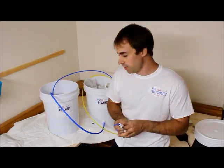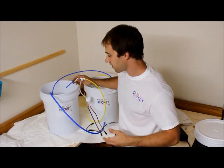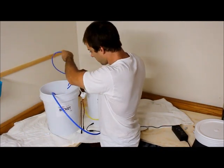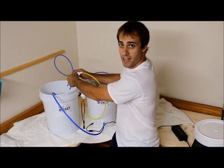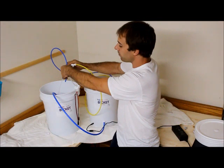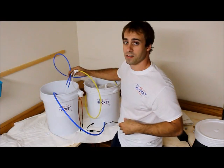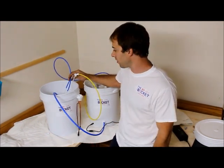Once it's plumbed in, you're going to turn on your bucket and get the sap flowing as you normally would, as though the pressure switch weren't even there. We're going to remove the air from the concentrate line, slowly dial down the needle valve until we get a 50-50 concentrate to permeate flow. Once the unit builds up pressure, we'll be ready to hook our switch in electrically.